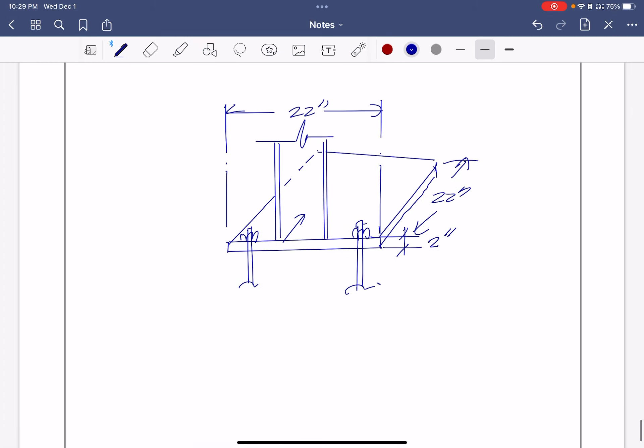A couple of AISC recommendations to note: unless they change the recommendation, the minimum thickness for a building base plate is three-quarter inch. Also, the minimum is four bolts — just do it, four bolts. This also ties in with OSHA safety requirements. You can go with more bolts if you start to have moments and the bolt starts to pull up, but that's a different design example entirely.